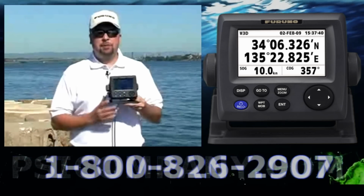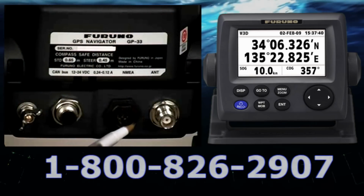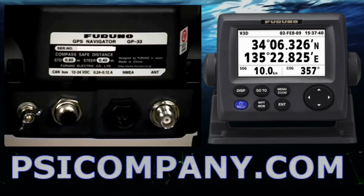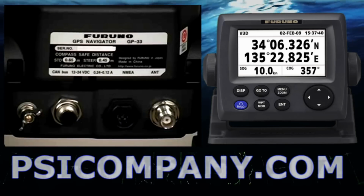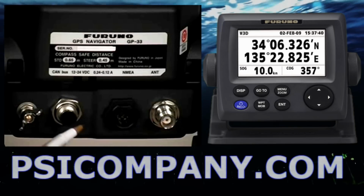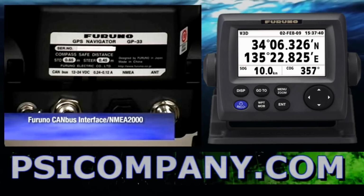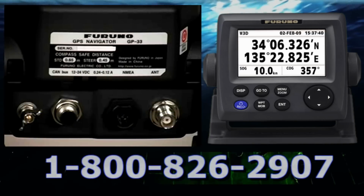Taking a look at the back panel of the display, you'll notice that we have a 10-pin NMEA 0183 plug here that can output RS422 or RS232. This can also be used for the MOB contact closure. Here we have a standard TNC antenna plug. And finally, we have a standard NMEA 2000 plug that uses our Furuno CAN bus system. We call it CAN bus because it is NMEA 2000, but it goes beyond the normal requirements of NMEA 2000.